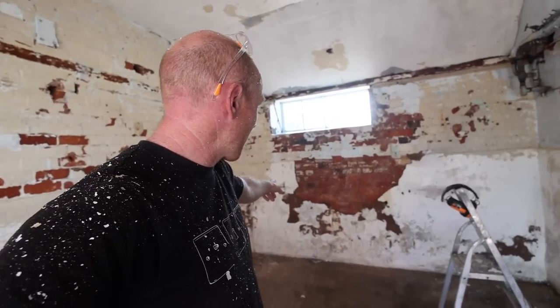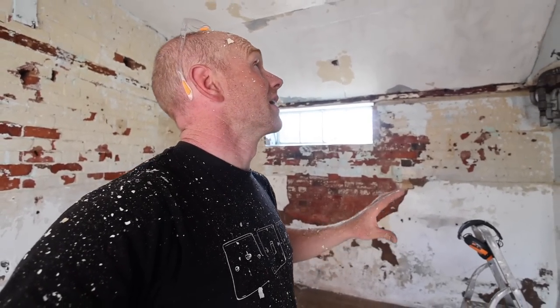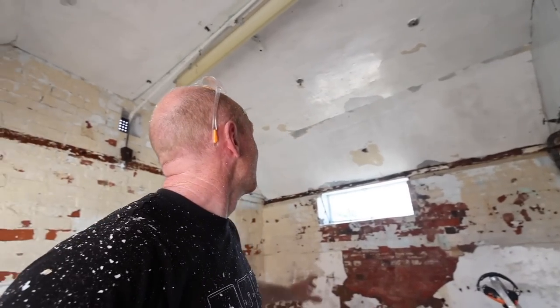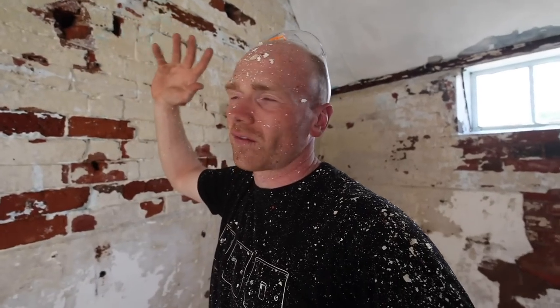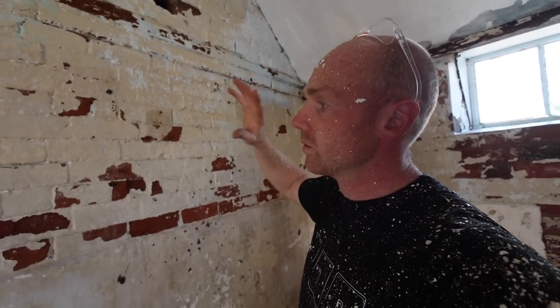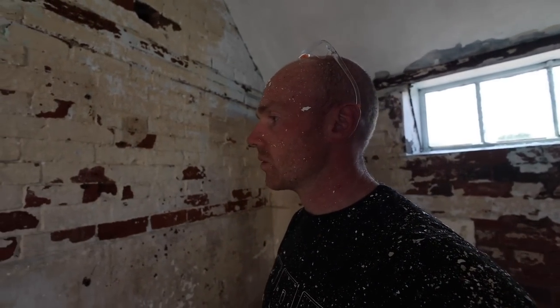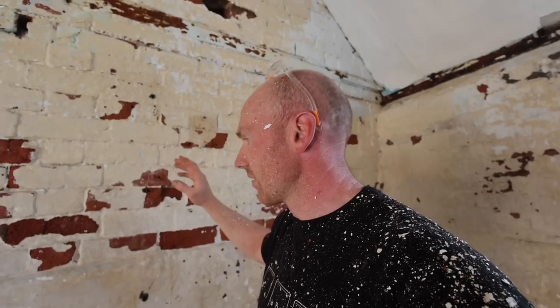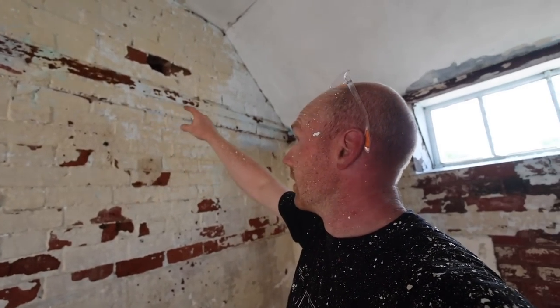It might just work — that means we're just patching that section. The key is we've got nothing loose or flaky. I've also washed down the whole ceiling, and apart from loose bits flying off, that can get painted. It's so warm and dry this week I'm not worried at all about driving moisture into the brickwork — the sort of thing I would worry about with a really old stone or brick wall. This is modernish brick with cement pointing; it's not an ancient building. That timber will dry out really quickly, so I'm going to get the worst of it off with the pressure washer before we start sanding and all that tedious stuff.